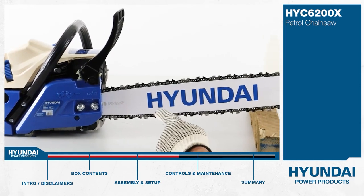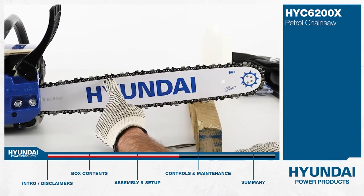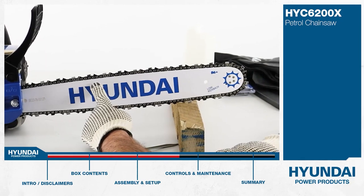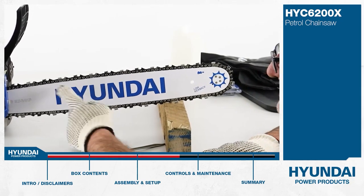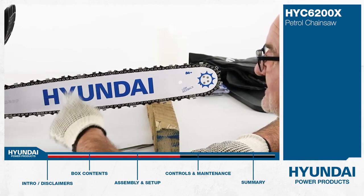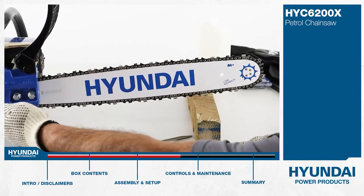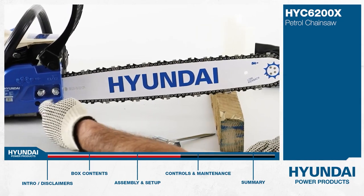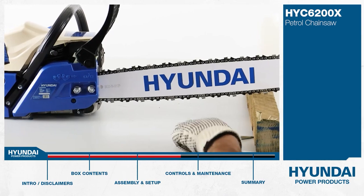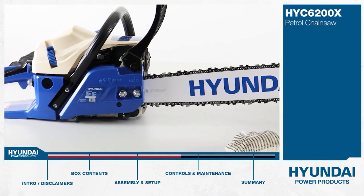Now what I will say at this point is that when you first start using the chain, this chain will do an initial stretch. So you may need to go through this procedure again of retensioning the chain. So just keep an eye on it during the first hours and days of use, just to see if that chain stretches, the chain starts to become slack. Just loosen off the two nuts, retension a little bit on the screw by turning it clockwise until you get to this sort of tension. And that's pretty much it. Once it's tight, make sure you retighten the nuts, and that's the optimum tension for your chain.